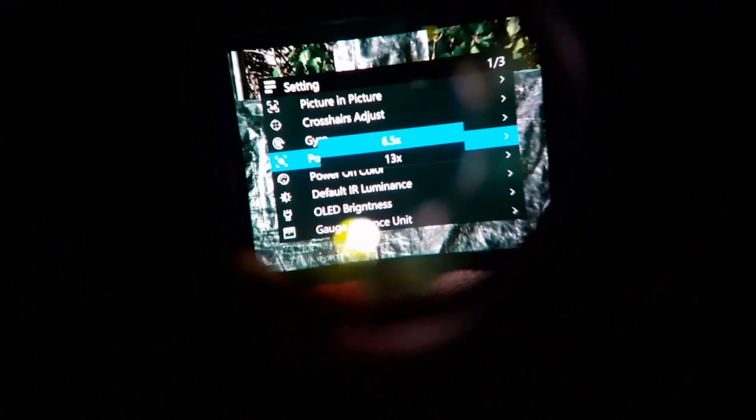Batteries: you can get batteries for these from Jaycar. It's an 18650 short. There is another 18650 which is about this much longer, just to make things annoying. This one's 2500mAh. These white ones here are the original ones that it comes with — not terribly descriptive about what they are, and the instruction manual isn't particularly descriptive about it either. It just says 18650 flat, so it took a couple of goes to get the right ones.